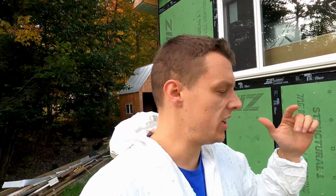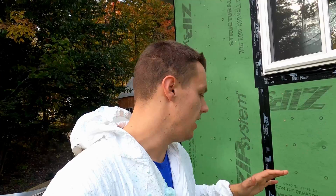All right, guys, so I just finished that 200 pack. We got a pretty good chunk done. My method to madness with this is, why don't we spray a thinner layer as much as we can, because we don't want to run short. So basically we'll go thinner and then come back with a second layer and thicken it up. You're also supposed to do that because if you spray too much at one time, it can drop and sag. So that's what you're supposed to do anyway, but let's look under there, see what we got so far.